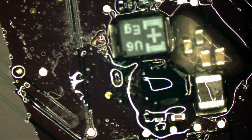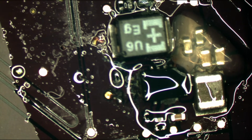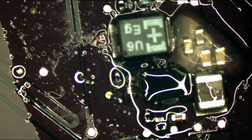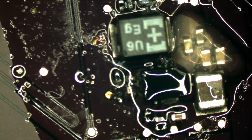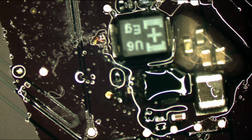Now, you're going to go back and forth, but while adding solder. The excess solder that you're adding is going to go up on there, and then you're going to clean it off in this little holder over there. At home, do you use a sponge or one of those little brass curls? Yeah, the sponge never works right. So, first step, am I just going across it without the solder? While adding solder.